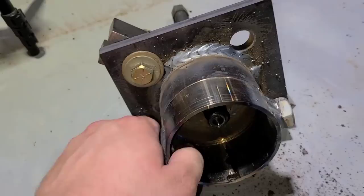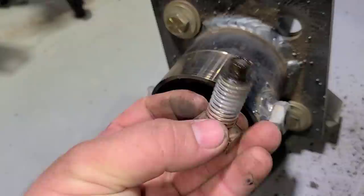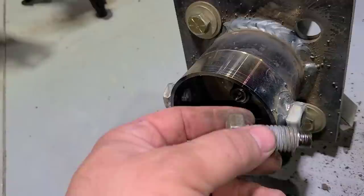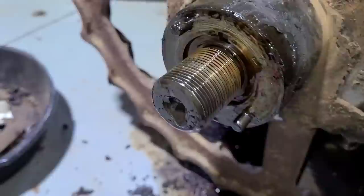And then attached to that I just have the OTC T-bar puller, in conjunction with these 5/8's nuts welded on there. I made these bolts in the lathe — they step down to 3/8's of an inch, about a quarter inch long, maybe about 300 thousandths. These thread in there, through here, and then these will actually bite into that hole there on either side, giving us something to grab onto — very similar to what Cat had, but not exact.